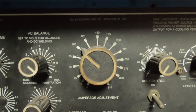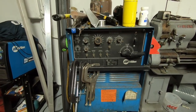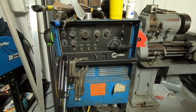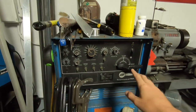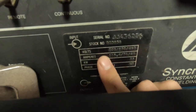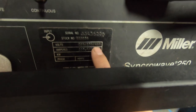Let's go into amps next. This is going to be kind of a difficult one. If you're running 220 at home — say it's in your garage, weekend warrior setup — and you've got a 50-amp garage circuit breaker designated for your welder, that's good and fine, but these old-style machines don't have the new high-efficiency technology in them. On this placard here, there are different voltages this machine can operate at: 200, 230, and 460 volts, with associated amperage draws for each voltage.